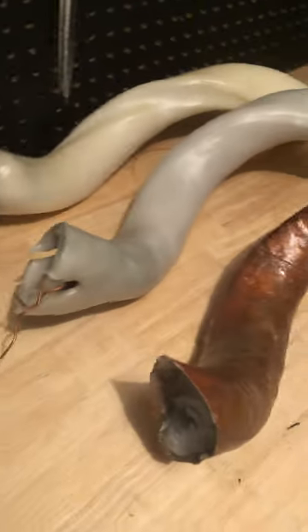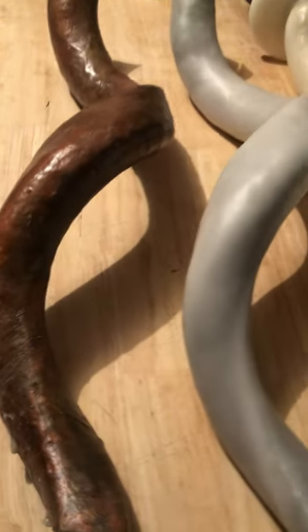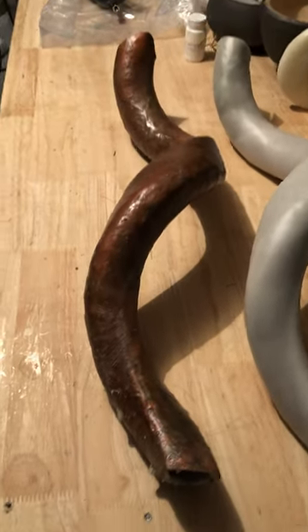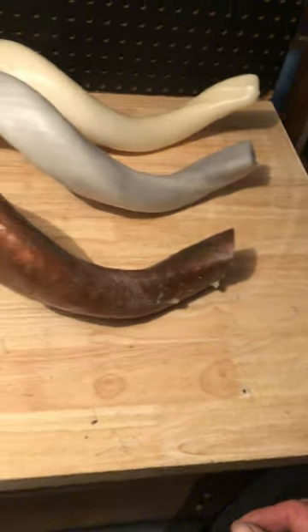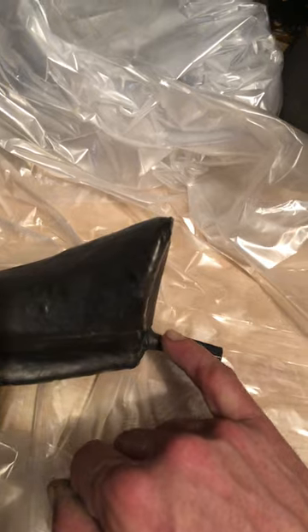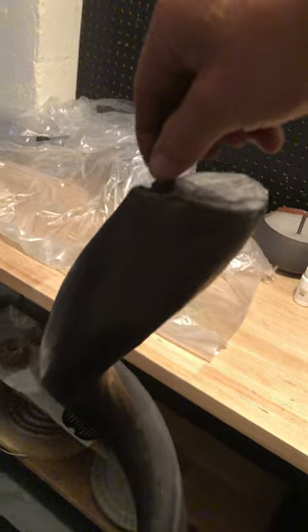From an antelope horn, dipped in wax, coated in graphite paint, and then electroformed for three days — once I have the electroformed part, I dip it in boiling water, melt the wax out, and I'm left with a cookie cutter. This is my cookie cutter, which I fill up with wax, and then embed at about this point a ball knob with an M8 threaded rod and a coupling nut, giving me a way to hold the part in the bath.